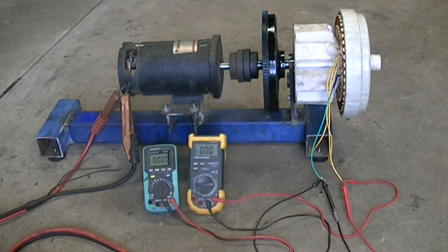So our progress so far — we've got the basic machine there. We're just going to spin it up and see what voltage we've got and what frequency we're at. This is on 24 volts. The yellow meter on the right is showing us our voltage in AC across one phase, and the meter on the left, the blue one, is showing us our frequency.